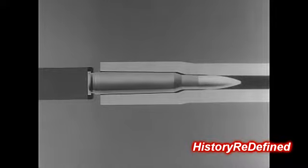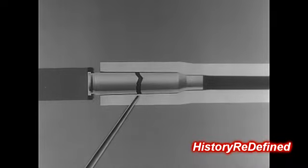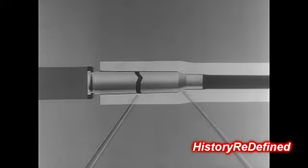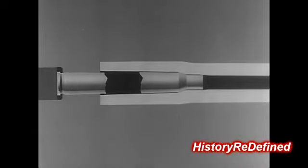If there is too much headspace — that is, if the end of the barrel is screwed away from the base of the bolt — the cartridge will not be fully seated in the chamber. The explosion tries to drive the loose cartridge forward into its proper position in the chamber, and since the head of the cartridge is held firmly in the T-slot, the explosion results in a separated case. Only the rear part of the case is extracted, leaving the forward part in the chamber, jamming the gun.